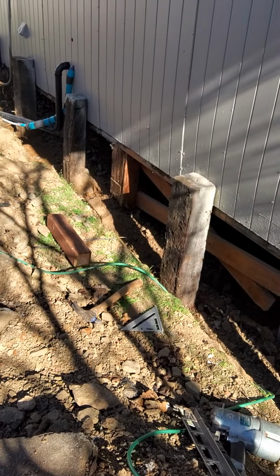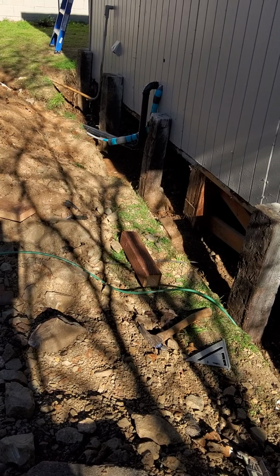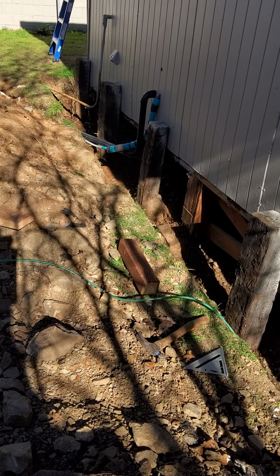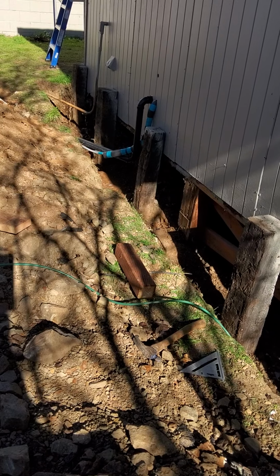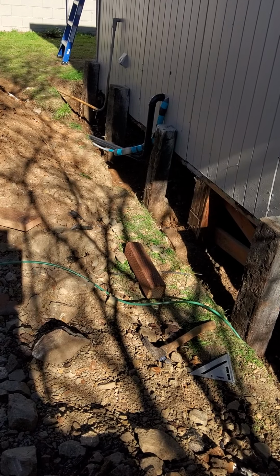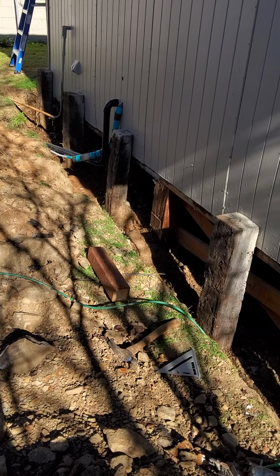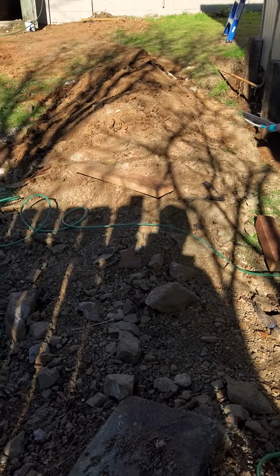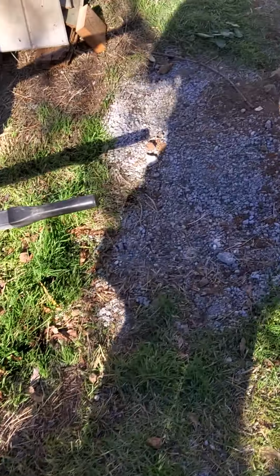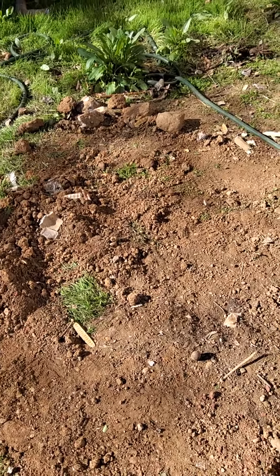Let me see. I'm going to be going over the whole house, so I went on the roof. It's going to be in the photos. I'm not going to bring my tablet up there, but I saw no evidence of leaks whatsoever, and I saw no corrosion of the galvanized screws. They use galvanized screws for the connections, which is obviously better than what you often see. A lot of people use those metal sheets for tool sheds, and they'll use the wrong type of screws with the wrong type of fasteners, and then those rust and create leaks, and the rubber washers eventually just corrode and cause a leak from the inside. So there are no issues like that in the house.